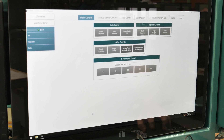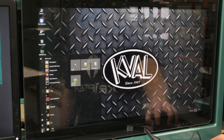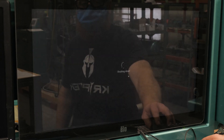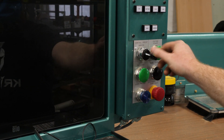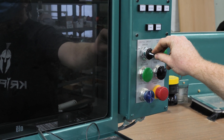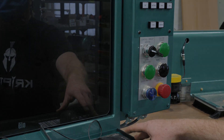To properly power down the machine, we can close out of the Cavalcam application, and like any other standard PC, click the Windows icon and the power button and hit 'shut down' — it'll go through its shutdown procedure. Once you see 'no signal detected,' it means the computer has been shut off and we can turn off power. If we simply go to the off position without doing this, over time it can corrupt the program of the computer and will cause problems. So it's important to shut down properly to protect the computer from potential harm.